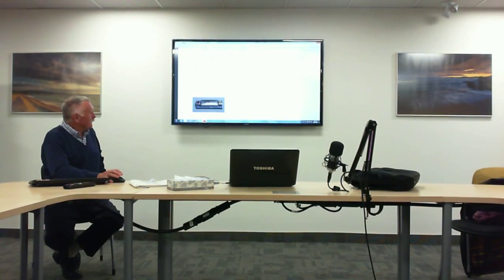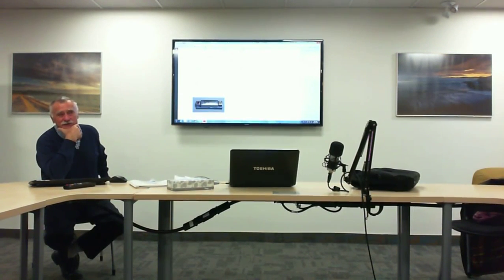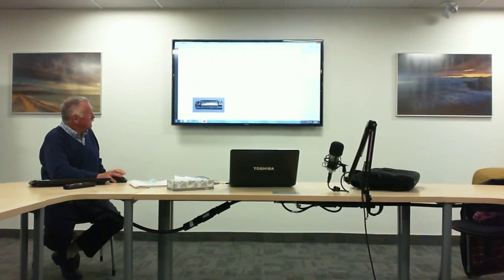But what if accidentally there is a radio station, as there is one, the worldwide clock from Boulder, broadcasting on 10 MHz. This 10 MHz radio station, if it penetrates into a radio, could get mixed with the 19 MHz local oscillator to produce the intermediate frequency. So now, you tune your radio to listen to 28 MHz, and you hear something in the background that you really don't want. That's the 10 MHz transmission.